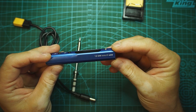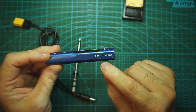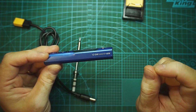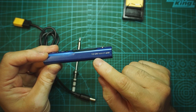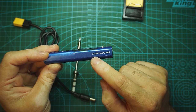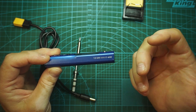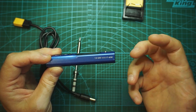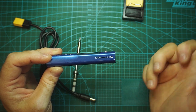As you can see it says from 12V to 24V and 17W up to 65W. The most important thing to note is that the maximum power is reached only at the maximum voltage input. So if you are powering it from 12V you will not get up to 65W, which means that if you are trying to solder a very big pad with a lot of copper you will have issues.